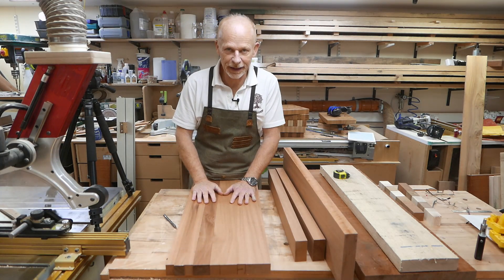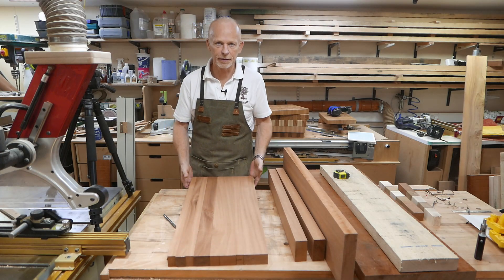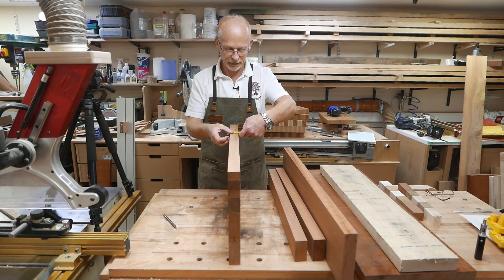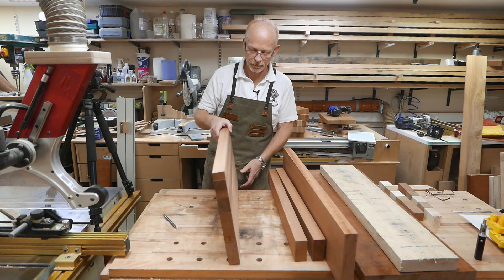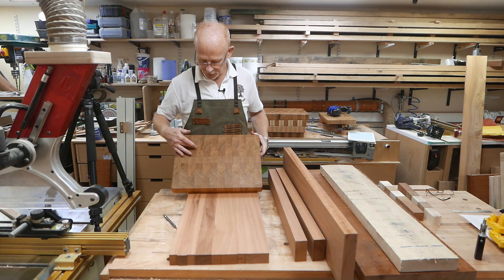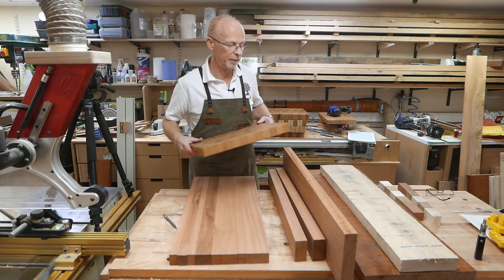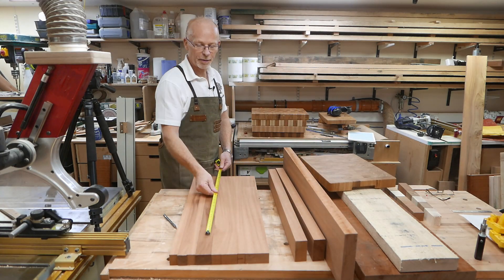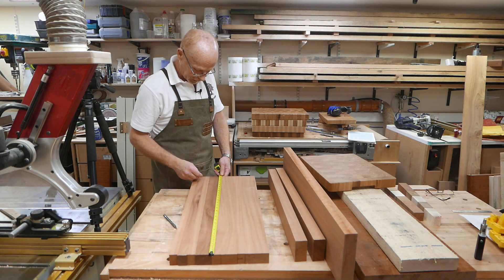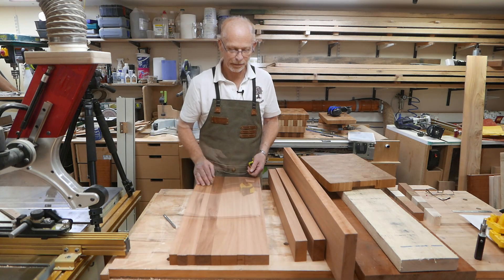When you've done that you're ready to start calculating what size board you can make. My finished panel has come out at 36mm, meaning the width of each row in my finished board will be 36mm. Knowing that, and now knowing what length the plank is — that's 700mm, but there are a couple of gaps at the joints and it's a bit higgledy-piggledy at one end — so I've got 690mm usable. Now it's time for the math.